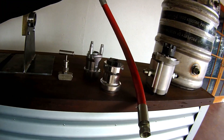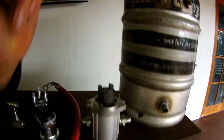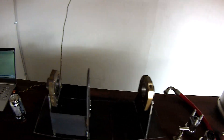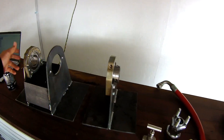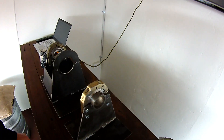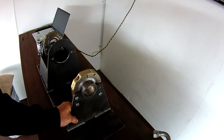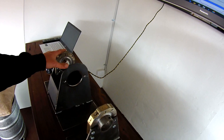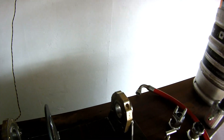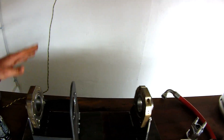We've got an example of the hose we're using — this is going to be our feed to the pump. We don't have any of the high-pressure ones yet. Over here are the axle stands. Obviously because we're hooking directly to the axle, the kart needs to be off its wheels. So we've made these axle stands from 5mm plasma-cut plate. If you're looking for CNC plasma cutting, SRF in Canning is a really good service. We've kept these as cheap as possible by using go-kart bearing carriers, which should be fine on the dyno because all they're doing is supporting the axle as they normally would.